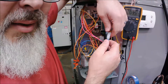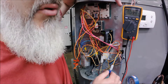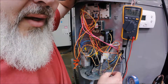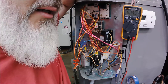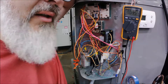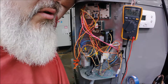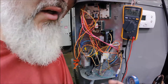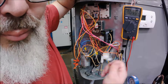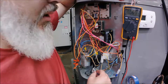Once we found that the high pressure switch was cutting it on and off, we bypassed it - but I only recommend that while you're there watching it. This is a troubleshooting technique, not something you leave in someone's system. They took the high pressure switch out of the circuit and connected the low pressure switch directly to the contactor coil, so we still had some degree of safety. Have your gauges hooked up, amp meter on the compressor, everything ready before you bypass. Don't bypass a safety and then go to the van to get tools - if there's a problem, you need to be able to turn that unit off immediately.